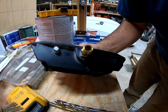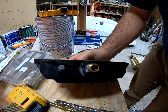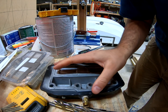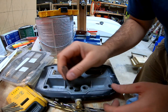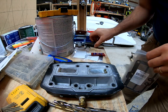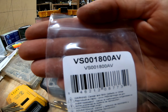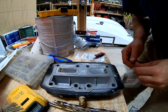The difference between a 753 head and a 755 head is this little port, which is supposed to be a bleed-off port on the exhaust side — so you could bleed off the tank that way, though I don't know why you would when you can just bleed out the screw on the bottom or your air hose. Gaskets are the same. Here is the part number for that reed valve for a 755/753 head: BS001800AV. They said this wouldn't work — we'll see if they're right. I'm right.